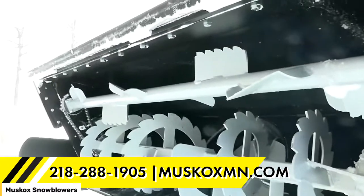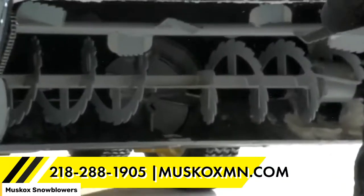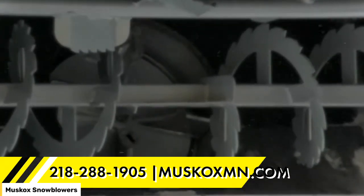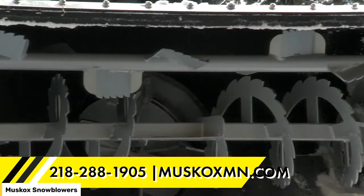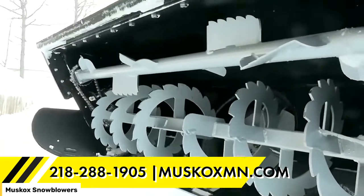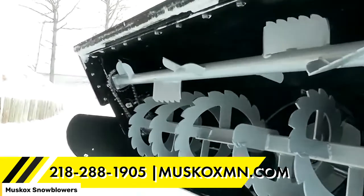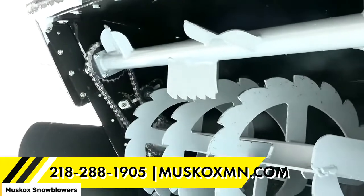Some of you guys that are watching right now are probably noticing on that main auger, we do operate with a slip clutch. So there is no shear pins, no shear bolts. So on cold days, you don't got to worry about that. It's a hydraulic slip clutch that we operate. And then it's our upper auger that runs off a sprocket and a chain, as you guys can see in the corner. And that's just for that upper auger. So that's, you guys are seeing the machine up close.